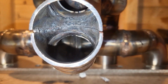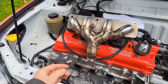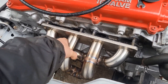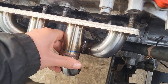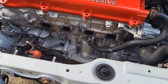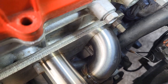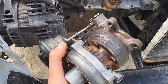The manifold isn't finished yet because I still need to add a small extension at the bottom going into a flange to connect to the turbo. But first I want to put the manifold onto the engine to see how much space I have. Here's the thing — when I designed this manifold I didn't really think about the oil feed for the engine, so I've made a manifold that doesn't even fit. However, I also have a grinder — and that worked. The manifold now fits onto the engine. I'll need to make a bracket to hold the rubber hose away from the manifold, but I'll worry about that later.